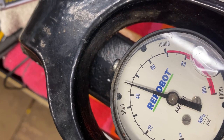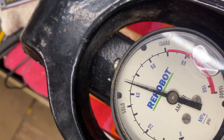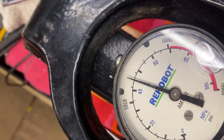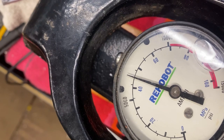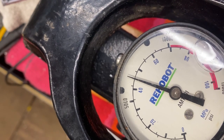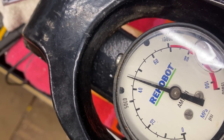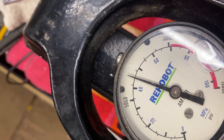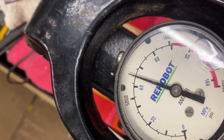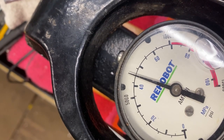Minimum 2 millimeters is enough. Even 1.5 millimeters relieves the strain from the corner and would be okay-ish. But yeah, 2 millimeters is safe. Anything over that is extra safe. And well, you always have to consider the fact that somebody accidentally drops the gun. So the more safety margin there is in that corner, the better, because it's a load-bearing structure also on the short reservoir, because that is the only thing holding the buttstock.